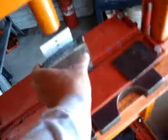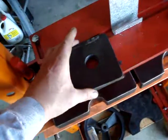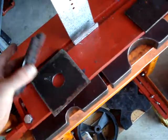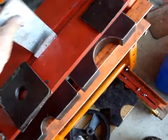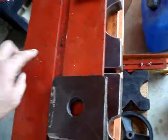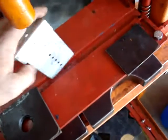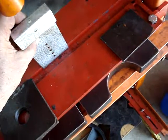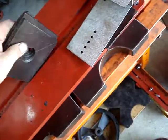So what I used is the bottom plate right here. These are scrap quarter-inch plate steel — they're all the same size, and I just stacked three of them together. When you determine the channel width, you have to take into account the fact that there's going to be metal in there. So put a shim on this side and a shim on this side, and stack your plates accordingly.